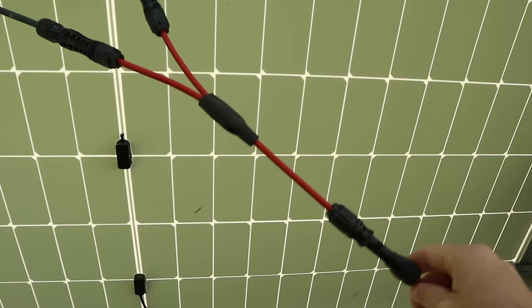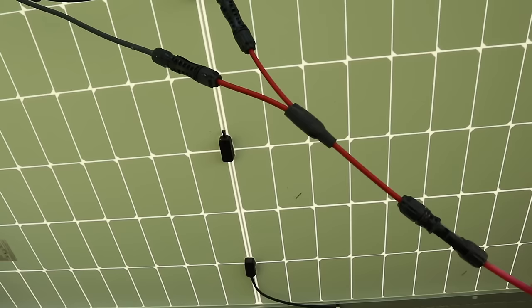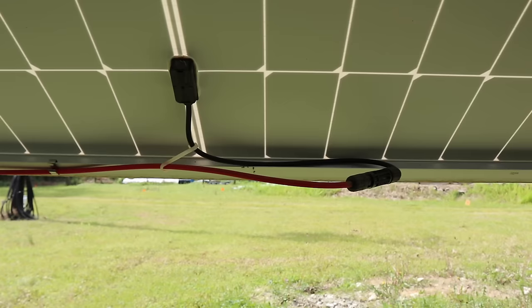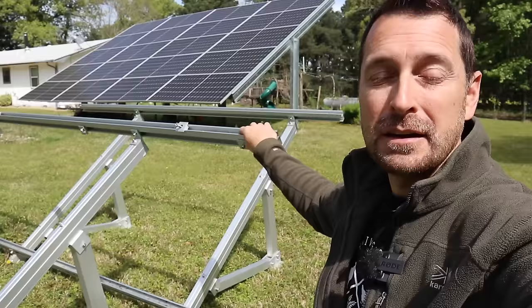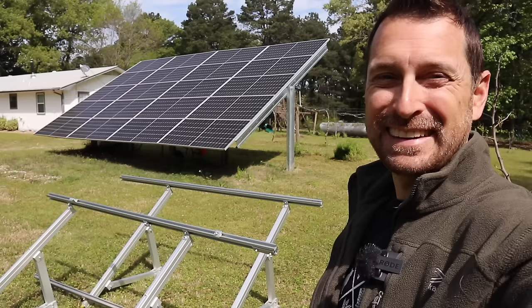When talking about wiring, you're going to need PV wire, which is rated for outdoor use and can actually be buried. It is 10 gauge and comes with MC4 connectors, which is how all panels connect together. You'll also need splitters depending on how you're setting up your system, and in some cases a combiner box to combine your strings together, along with small extension cables for your PV wire. If you have just a few panels — this one holds about four to five — that smaller option might work for you. I'll have a full list of all parts in the description below.